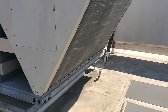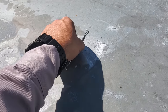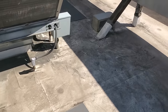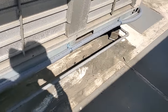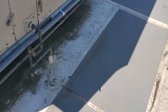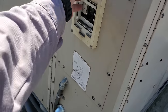We are back today. We had the electrician come out. They ended up redoing the entire electrical run, getting rid of all that crap EMT stuff and giving us a whole new run all the way over. So we are going to go through this unit now and figure out if everything was done correctly and if the phase rotation is correct.